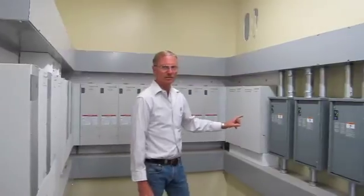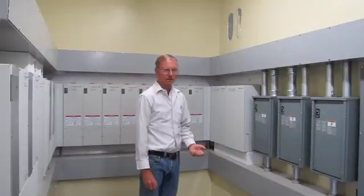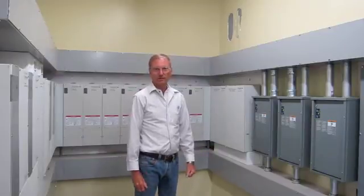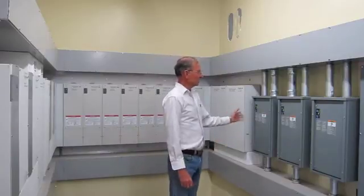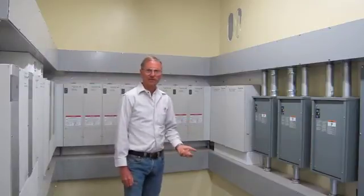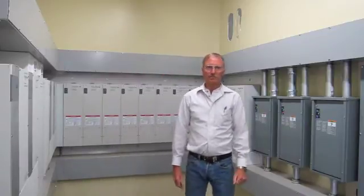On this side we're going to simulate a power outage in just a second. One of the things Jerry wanted to accomplish was something that would not require any user intervention if there was a power outage — the homeowner doesn't have to be trained. These are transfer switches for each of the clusters of inverters. It doesn't matter which one goes down — it will start the generator, roll over, and run on the generator. When the condition that caused the problem is corrected, it all reverses and goes back to just solar.